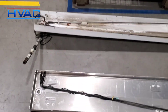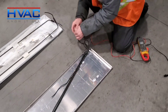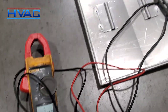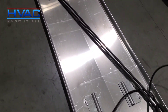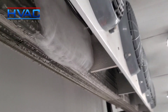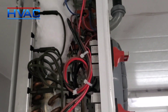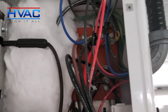Here's the new pan and you can see it is very straight — the old one is warped. We'll just check the heater resistance to make sure it's the same. Our new heater is the exact same resistance as the old one. We also have ice buildup on the evaporator still in a couple of different spots and ice buildup around the electrical, so it's really good that we're taking this thing apart to find out what's going on.